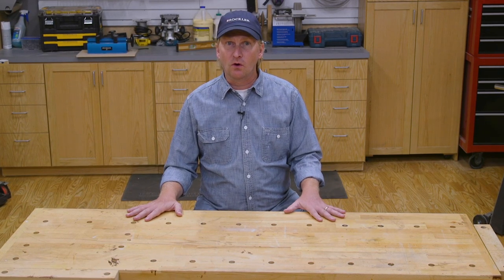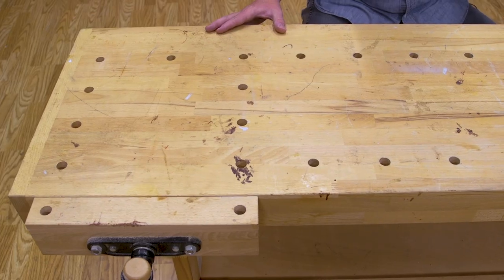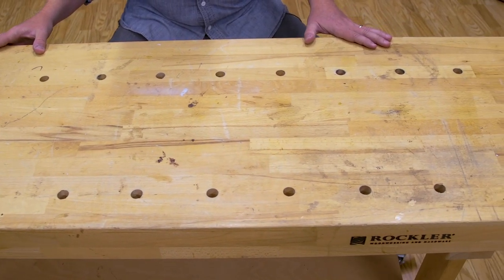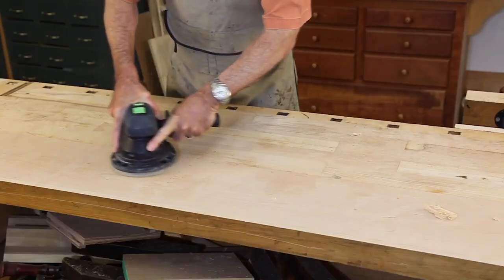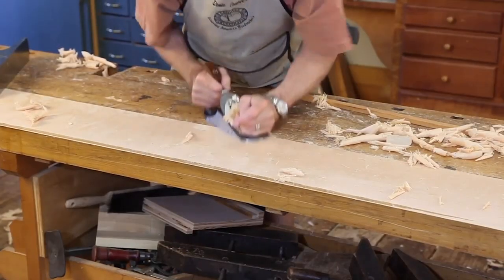Now speaking of the top, like I said before, it has to be flat, but it doesn't necessarily have to be pretty. In fact, a workbench top that shows the scuffs and stains and the age of years of hard work can be a beautiful thing. But let's say your bench has seen better days and you want a fresh start — that's really a refinishing job. All you need to do is scrape, sand, or even use a stripper to bring you down to a fresh surface, put on a new top coat, and you're good to go. And if it's not flat, you can flatten it with hand planes, or if you're lucky, you've got access to a large thickness planer or drum sander that will fit your workbench top.